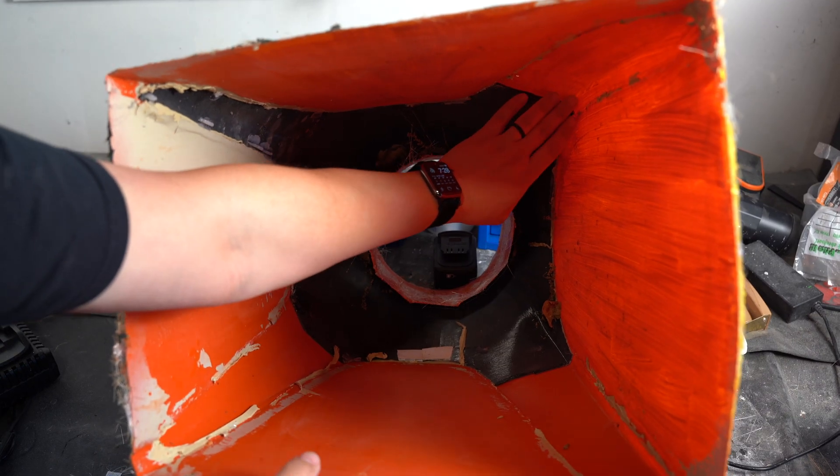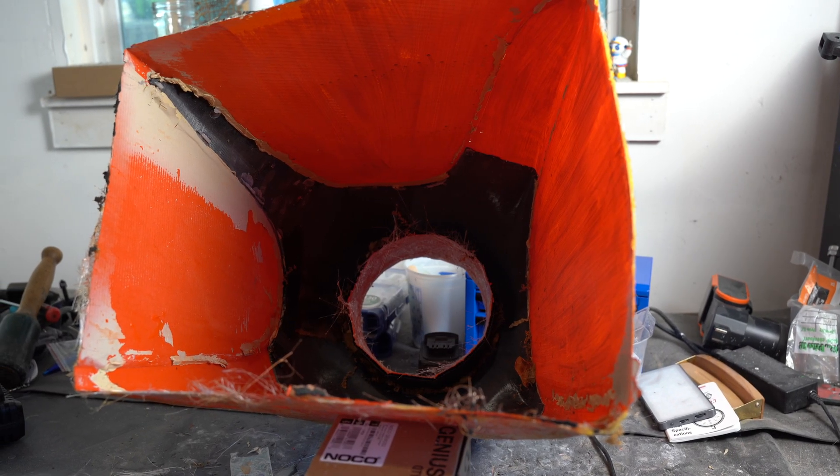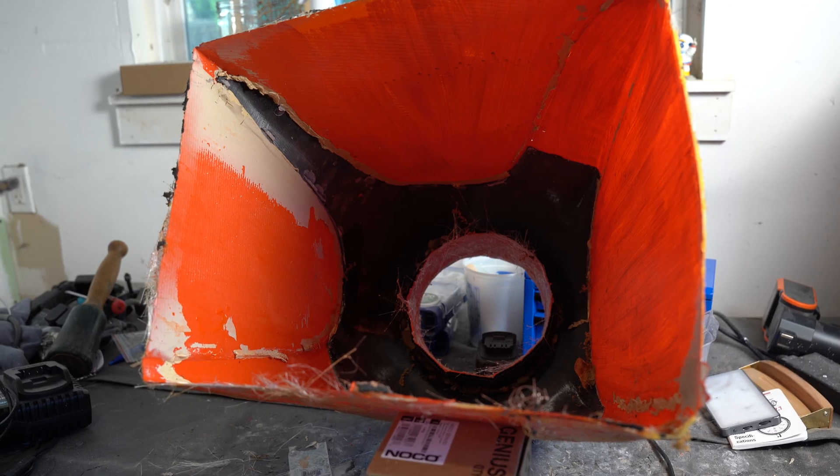Well, it's messed up. One of my philosophies is learn by doing, and messing up is what I did with this mold — it is not usable at all. The issue is I should have done a split mold. I 3D printed it, got everything ready, smoothed it out, made it look perfect, gel-coated it and wrapped it in fiberglass. But I can't get the 3D print out — it is mechanically locked. So what we have to do is make a split mold.